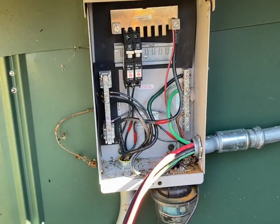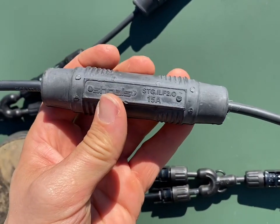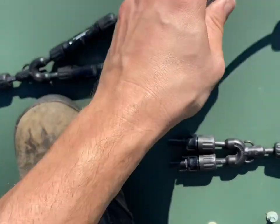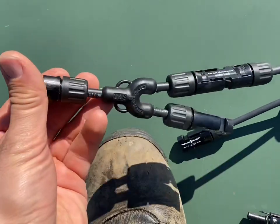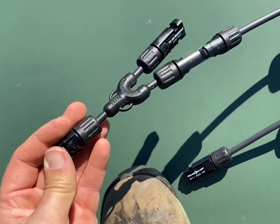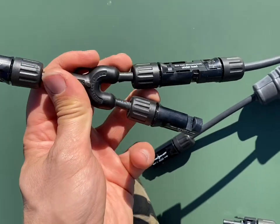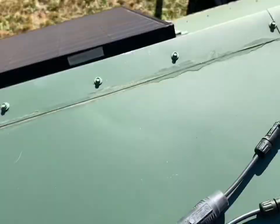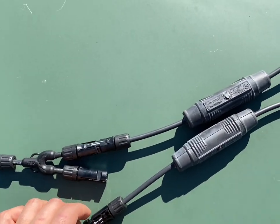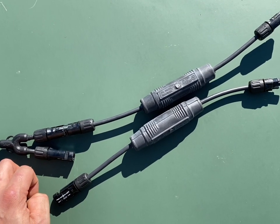Here's my dirty combiner box — I'm just going to pop a 30-amp breaker in there and she's ready to go. These are 15-amp inline fuses by Shoals — some solar farm-grade stuff. This is a Staubli MC4 brand, also by Shoals, with MC4 connectors on it. This is just a Y-connector — this is how we're going to combine without a combiner box for these two strings. It's kind of solar farm style but also Amish style — nothing wrong with doing it like this.